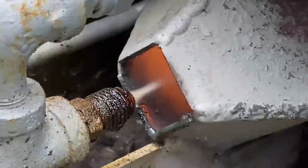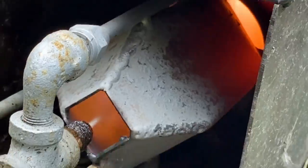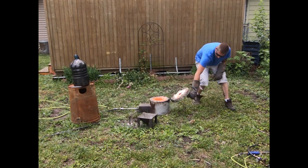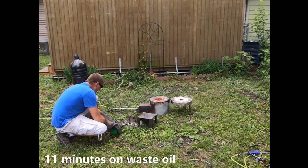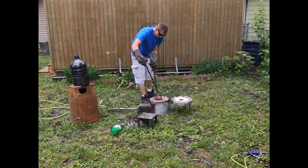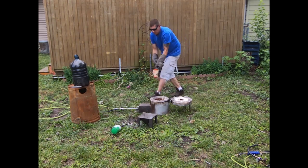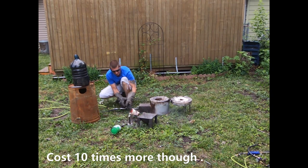My previous record was held by this old Godzilla burner — this is one of my old Godzilla-with-preheat designs, but it's a very old version. I've since bored out these nozzles to where they breathe a little bit better, so I might be able to shave off a couple more minutes. We might have to do a rematch here. This machine gave us an 11-minute melt time for that same kilogram of brass, and I did use a substantial air compressor — we were at about 110 PSI. If I bore this thing out we can run it at 135 PSI and get a substantial performance increase. But at the end of the day, the concrete jet engine would still probably outdo the Godzilla because it's just so ferocious — it puts so much fuel and air through it.